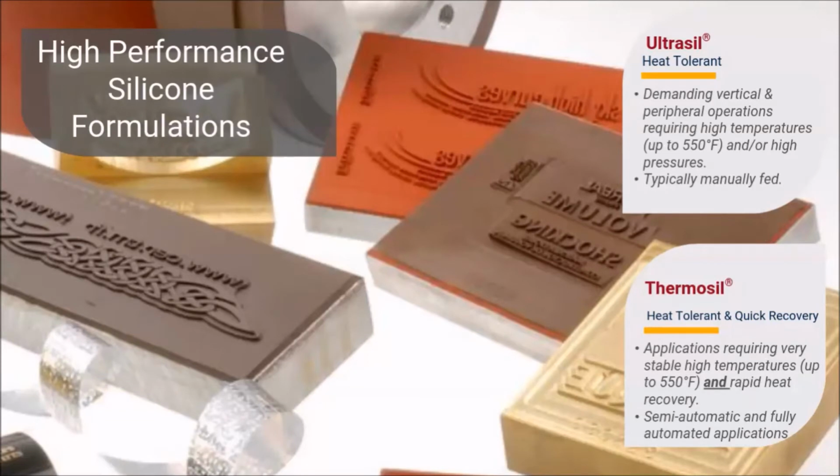Let's start with high-performance silicone formulations. CER and United Silicone offer different silicone formulations, each carefully engineered to meet specific performance requirements. Our UltraSil formulation is well suited for demanding vertical and peripheral applications that require temperatures as high as 550 degrees Fahrenheit, as well as high pressure. Typically, UltraSil is used in manually fed situations.